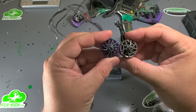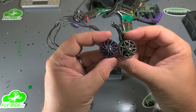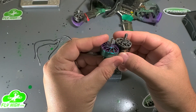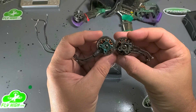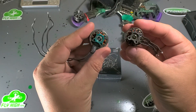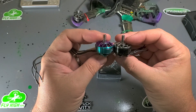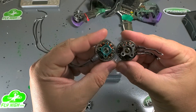Let's do a little more comparison between the motors I run — these are the T-motor F60s — and these MEPS. The first thing I notice is that the windings look pretty similar. You've got quite a bit less hub meat on the MEPS, though. These spokes just look quite a bit thinner — they're tall, but very, very thin, which makes me concerned about durability. Looking at the bottom, you'll notice it's a quite a bit larger diameter motor. These are 2207.5s and these are 2207s, but the 2207.5s should be a little taller. The diameter does not look the same — they're just quite a bit wider.